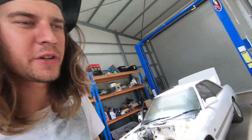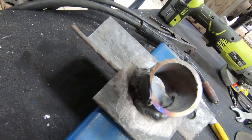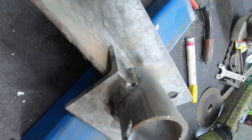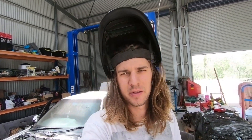That's pretty much it. I'm a bit rusty on the welder and galvanized steel is a real pain — no matter how much you clean it up you still lose your weld pool when you hit the gal. But it's made, it'll do the job. It's not beautiful but it should be effective. I'll flick a coat of paint on it and we'll be testing it out as soon as I get some steel ready, which should be very soon.